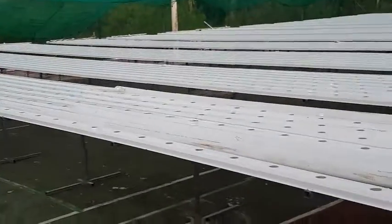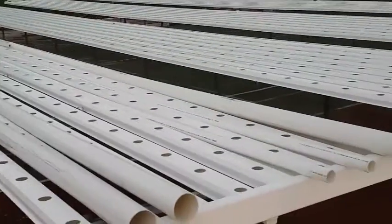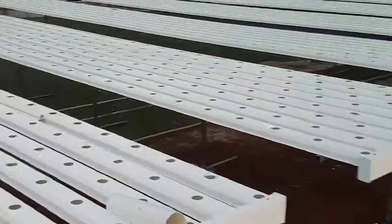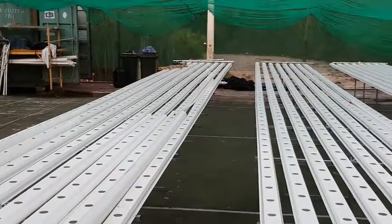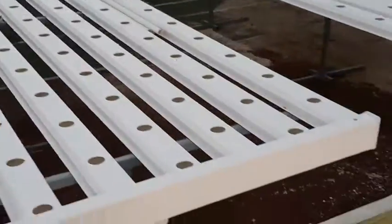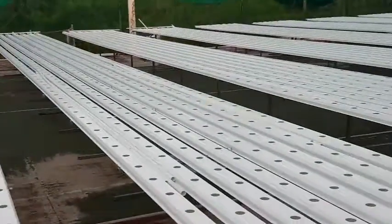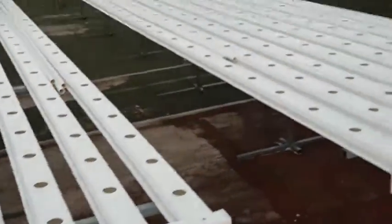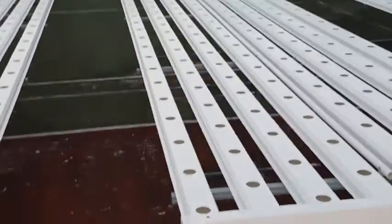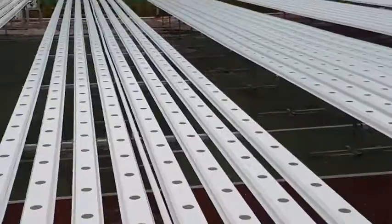Here we are on Hydro Nauru, it's the morning of day 7. Today we're going to get these drain and feed lines in place. As you can see, we've got all the benches of the first 12 in place and screwed down. We've just got to put the feed line manifolds on, make a couple of adjustments, bend down the ends, and then we'll be putting in the feed lines and drain lines back to the tank today. We'll also be securing the shade cloth.